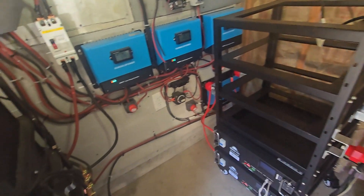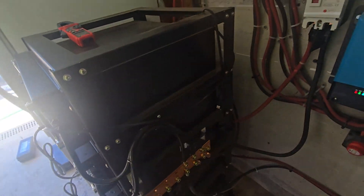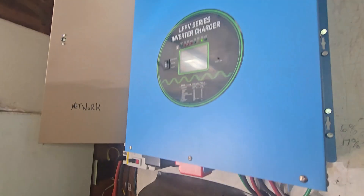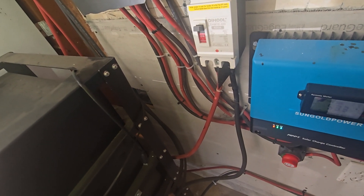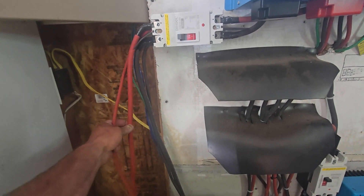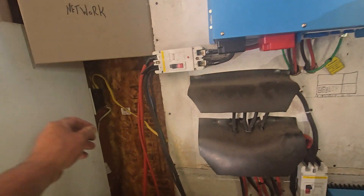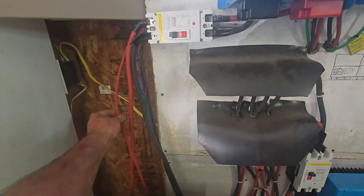All these batteries now tie into the two bus bars, and from the incoming is 2-AWG wire which feeds both bus bars, then out of the bus bars going up to the 18,000-watt inverter. When it pulls DC power, it pulls a lot. I have a 2-AWG wire and a 4-AWG wire feeding up into the upfeed, because when this really kicks in it'll pull about 300 amps DC. When I just had 2-AWG alone they were getting pretty warm, so I added the 4-AWG — now no problem at all.